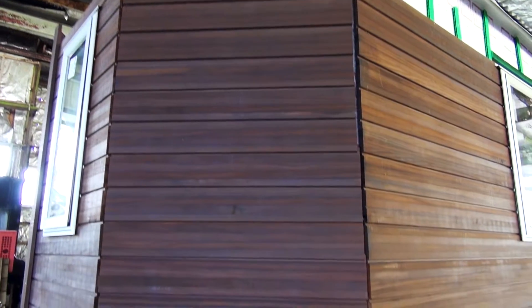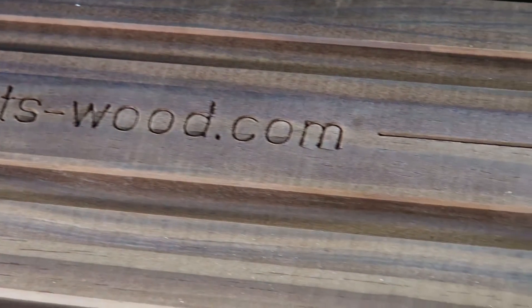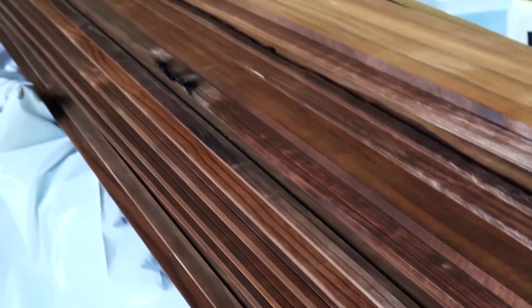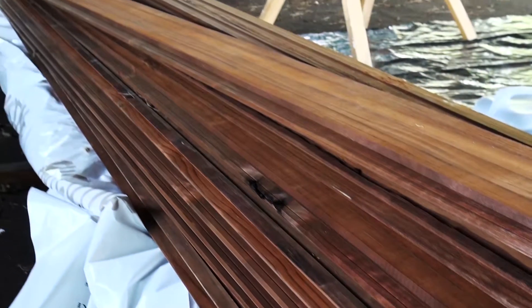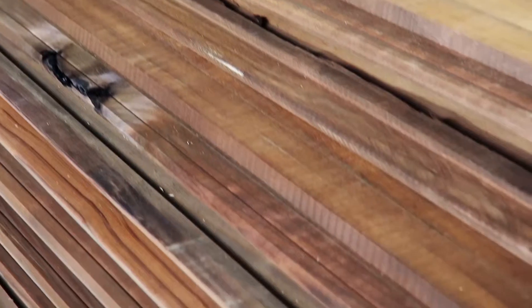We are really excited about our Elements Vulcan cladding from Obodo. This thermally modified pine weatherboard is both heat and steam treated, so it becomes more resistant to decay. The final product is much lighter in weight and even has a 20% higher thermal performance. It's totally non-toxic and is sourced locally from FSC certified timber.